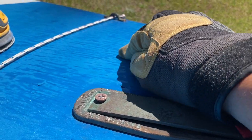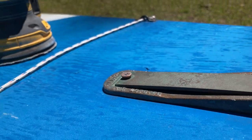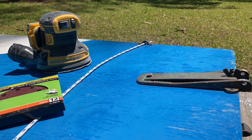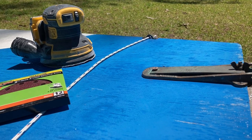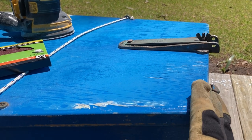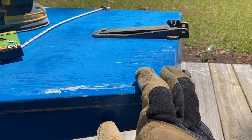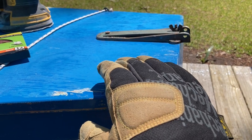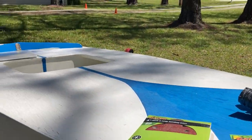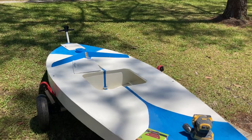Once again, we're going to address the little valleys that are left behind from checking with some thickened epoxy. We're going to use THIXO to fill that and seal it, and then prime and get another coat of paint. We like leaving these finishes if we can. This is not even a year old, because we'll just build and build and build primer and paint to get a nice finish back on here, both protective and cosmetic.